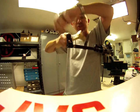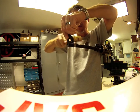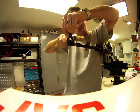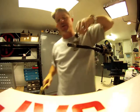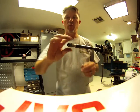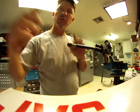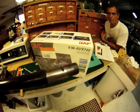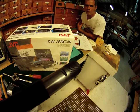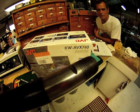Now, to finish the job, I'm just going to take a brass hammer and lightly put a few wraps to it. There we go. So now that our sight's off, we're just going to set it aside. We want to make sure we don't lose our pin. When you're all said and done here, we would have a nice smooth barrel. We're imagining these threads aren't here yet. You'll notice here on the top — that's the notch that the pin goes in. That's what's going to make sure that your front iron sight is re-clocked to its original position.